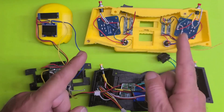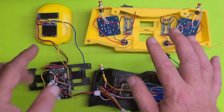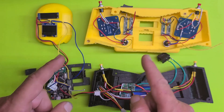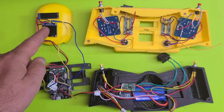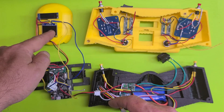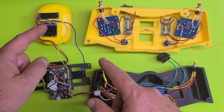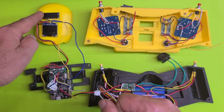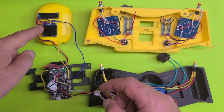This is going to be something you'll all have to watch out for in your own specific cases, because you may need to adjust those addresses in the code. I'll explain all that in detail on my instruction web page. The second problem is the OLEDs — I had both working great, but I bought a handful of new OLEDs and used one in the new circuit, and they were both displaying the same exact thing because they shared the same address.